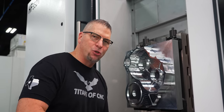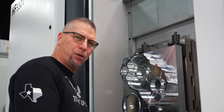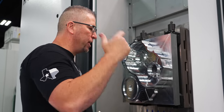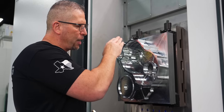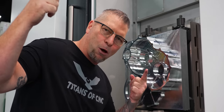The HF5500 at 1,650 inches per minute just slaying and murdering material — so good. I still have a few more things to do: I'm going to put the part back into the machine, I've got some threads going around here, an O-ring groove, and then we'll be ready for the next stop. Thank you guys so much.